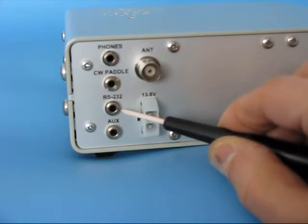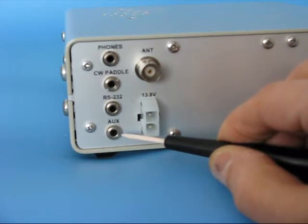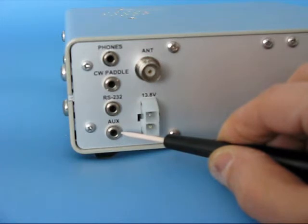This connector is a serial communication connector RS-232 for software updates. The lowermost jack socket serves two purposes: you can configure it for external PTT input and PTT output, or alternatively you can output quadrature I and Q signals for PC demodulation using software like WinRAD and similar.